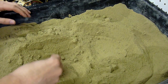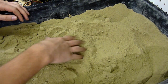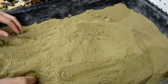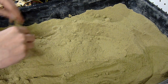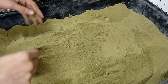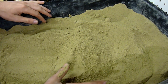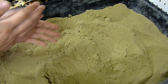You can use play sand and ground-up cat litter, stuff from Home Depot, or go to a pottery supply store and buy powdered clay. I'd always recommend mixing it dry and then moistening it, because I made the mistake of making a clay slip and mixing it with the sand — it ended up way too wet, and I had all sorts of problems with lumpy casting sand. So this is properly tempered green sand. In part two I'm going to show you how to make a mold out of it.